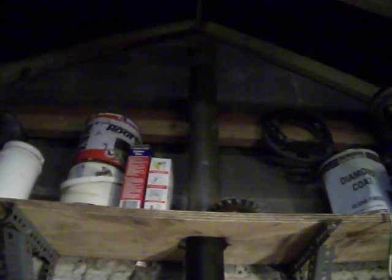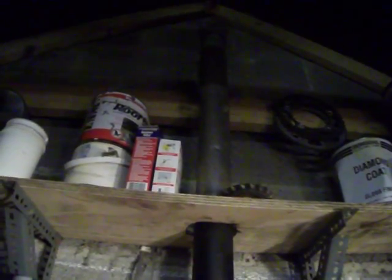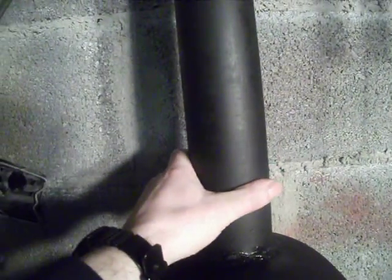I have a 3-inch bus exhaust as the chimney — about 10 foot of pipe, which rises to a 45-degree bend through the wall and another foot to take it above the apex of the garage. I was worried that this exhaust wouldn't draw well enough, but it draws quite well actually. I think it's because of the length of pipe and a fairly gradual bend, as opposed to a sharp bend.